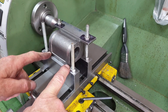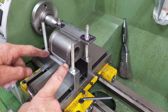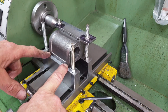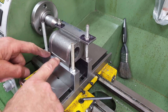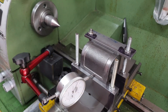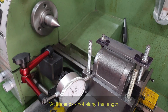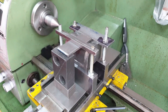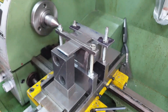To position the cylinder block with respect to the axis I'll use the dial gauge and get both of these ends roughly the same. I'm not looking for hyper accuracy here and of course this is a cast face so it's not going to be flat by any stretch of the imagination. That is within 0.03mm — I'm more than happy with that. I'm sure there's a really good reason why I shouldn't be using these clamping posts as I am, but let's see how we get on.